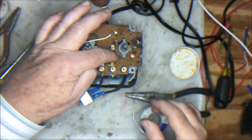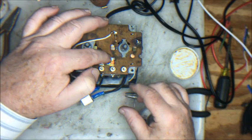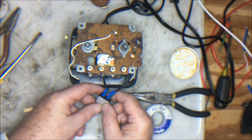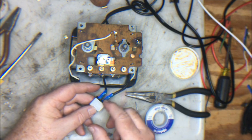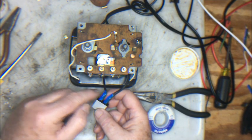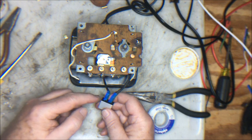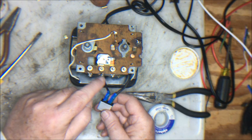Soldering. Okay. Notice how we've taken the circuit breaker wire off of the aftermarket circuit breaker that was here, and we connected that to one fork of the Bussmann thermal breaker. We've also covered it in shrink wrap, which we've used a simple hairdryer on to shrink it around. The second wire, I took a 16 gauge wire so that itself would not generate a whole lot of heat, and connected that to the other prong of the circuit breaker and up to the B post.